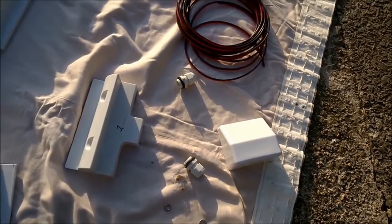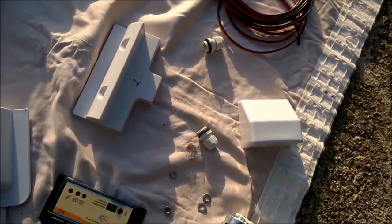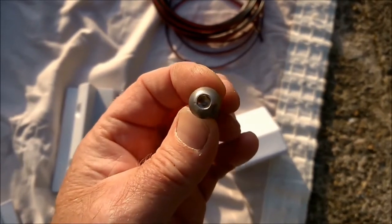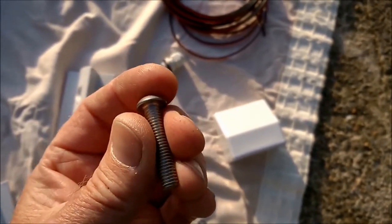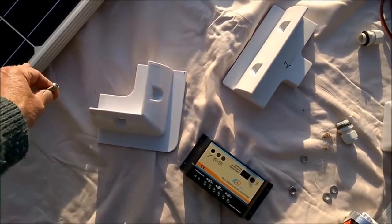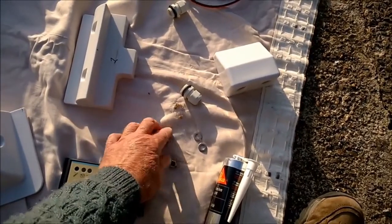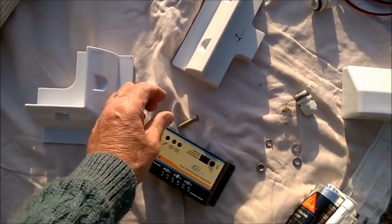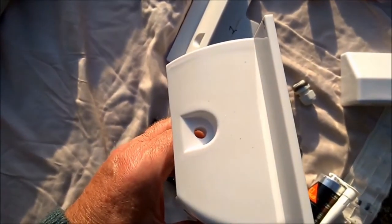You need bolts to fit the corner brackets to the panels. I went through several different types of bolts until I got ones that fitted properly. I've got stainless steel button heads with a hex head in them — M10, 35mm long, which seems quite long, but you've got quite a thickness of corner panel and bracket to go through. I've also put washers, probably unnecessarily, and a lock washer on there. The reason I went for a button head is because it's very difficult to get the socket into the cutout in the bracket.